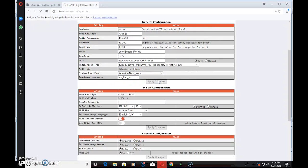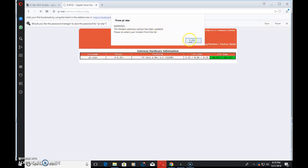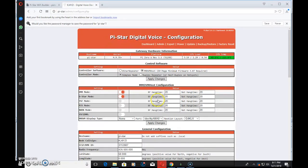After the reboot, you still see nothing on the screen — do not panic. It does say the modem selection has been updated. Now reconfigure the modem again: select STM32-DVM Raspberry Pi Hat. Everything else should stay the same. The important thing now is your DMR ID — make sure you put that in. This is a big deal: people don't put their DMR ID in their radio programming or the hotspot, and it has no idea who you are. Once you have call sign, DMR ID, and frequency confirmed, hit Apply and let it reboot again.